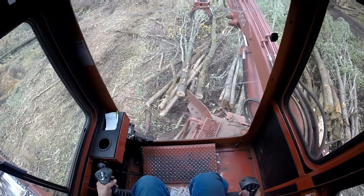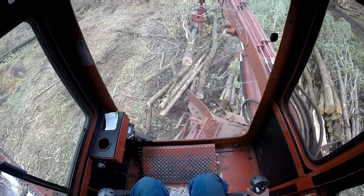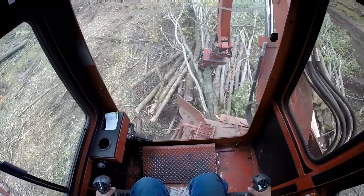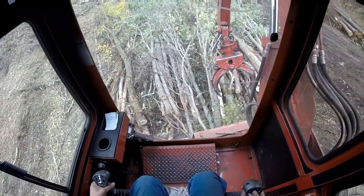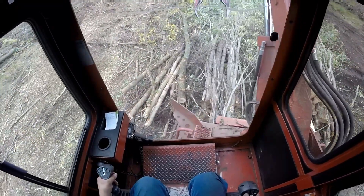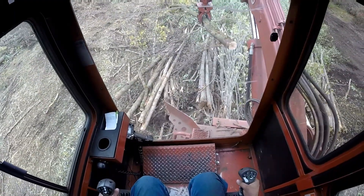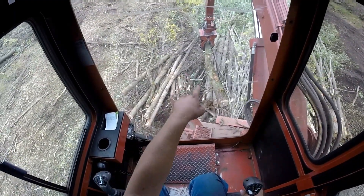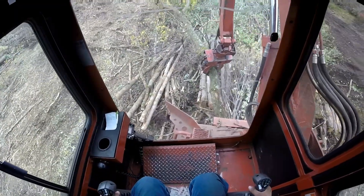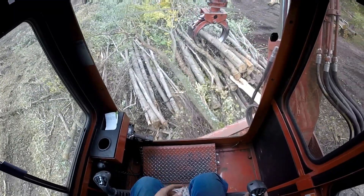One thing I learned was to always grab the wood that's on top — as far as the top of the tree is on top. So that when you flip it in like that, there's nothing stopping that top from flipping over. So like this nasty ash right here, see how the top of the tree up there is on top of everything? That way when you flip it over to the middle of the chipper, it feeds right through.